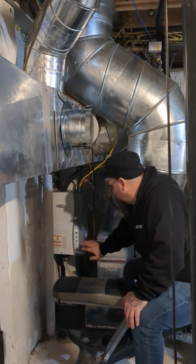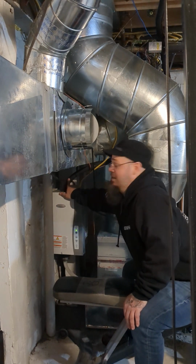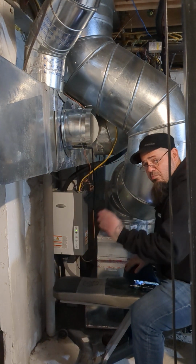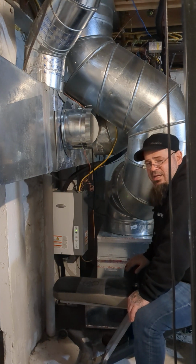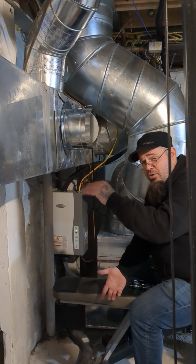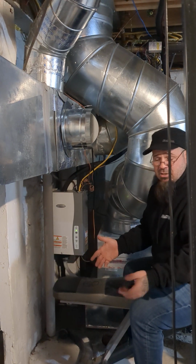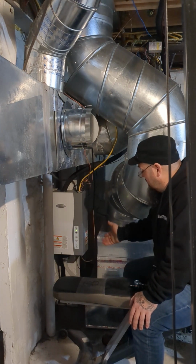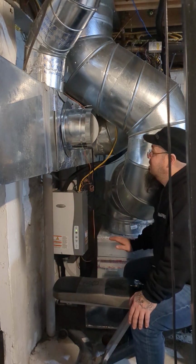And excuse me, this one happens to be tucked all the way back in here. This is the beauty of it. See how this is remote? This is hanging over here. And then this right here, if I can try to stay out of the way, that is your steam generation line back there, okay? And that allows you to install this thing remotely and then basically pipe over to your supply ducting, which stops a lot of the shenanigans that go along with the other two types of humidifiers, which is trying to squeeze them in, especially now that coils are getting so much bigger on units to get the efficiency that they want. They're getting so tall that there's not enough ductwork left to get the humidifiers in like they used to when the coils were so much shorter. So this really gives you some great flexibility about unit placement, and here's a perfect example of one because there's just not enough room vertically to get a standard humidifier in on this particular system.